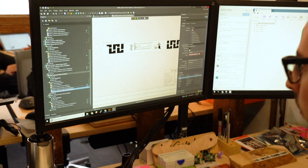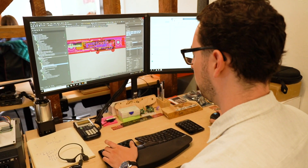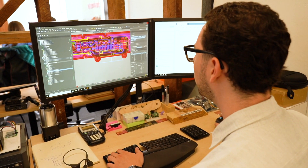We did a lot of back and forth — it's all custom flexes in there that do our various interconnects. They would go into their model and I'd work with them to try to figure out the exact bend radii for the flexes. Some of them are more complex bends with multiple angles and things like that.